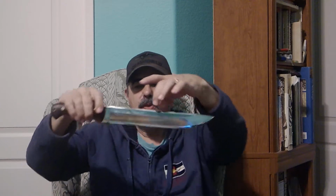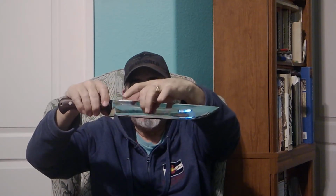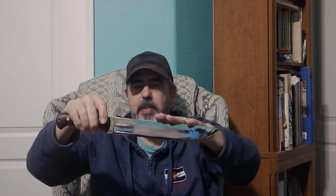Well, for a large camp knife like this, that's going to be used for splitting wood and chopping and doing a lot of different types of cuts, I want that knife to have certain flex with it and be forgiving from the blows that I will put upon this knife. So that edge is going to be at a higher Rockwell rating. It's going to be harder than it will be up at the spine.